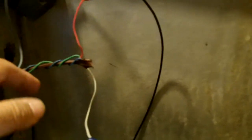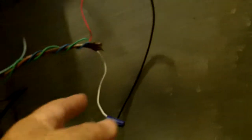I had another transformer, brand new, nothing wrong with it. Because yes, I do keep these kind of in stock. But anyways, I said, I have a primary and I've got a secondary. Secondary, I know, has to feed the call for heat, this is 24 volts, the white, call for heat from the thermostat. This is your stat line. There's a blue and a green, that's used for air conditioning and fan on, permanent all the time, which is green. These aren't needed because this is heat only.